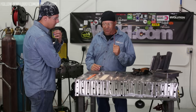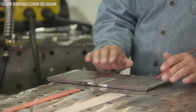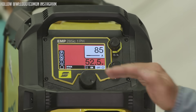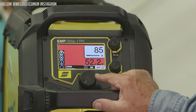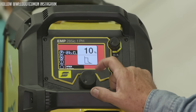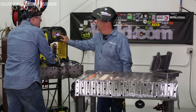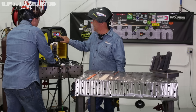We'll run both roots uphill. This one has a little bit tighter gap. I'm going to run both of these roots at 85 amps, so that part doesn't change — that'll be on the 6010. We need to come up here to the parameters. Arc force is right now set at 10 percent. We're going to run one of them at 10 and turn the other one up to 100 or so — way different. The machine also has a setting for 6010/6011 or cellulose rods versus all other rods, so when we go back to do our 7018 we need to make sure we set that correctly as well.